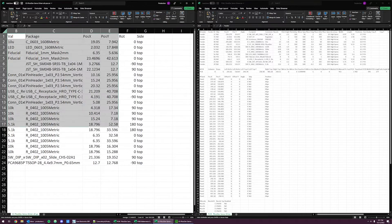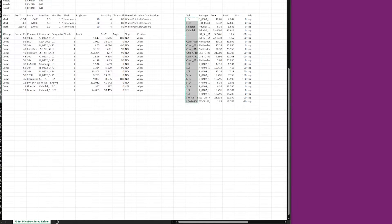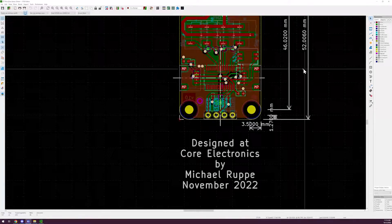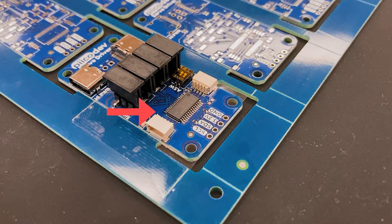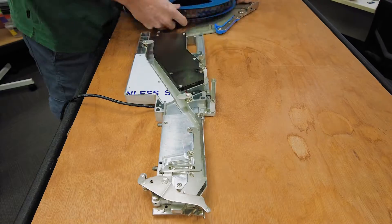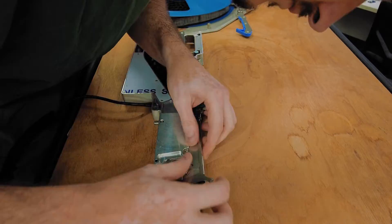From there we can export the component positions in KiCAD. You bust out the PCB editor and export the position file, which is referenced to some origin - the place origin. I've put this in the bottom left of the board. This job uses a couple of new components we've never used before: namely the surface mount header and this big PWM IC. We were very fortunate to get these headers on a reel, which is just the preferred way of working with components.